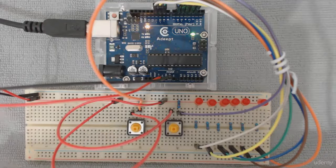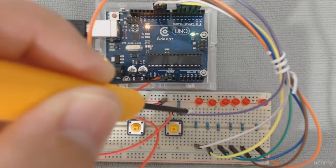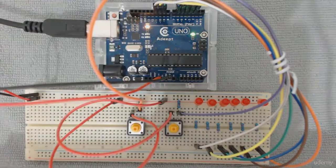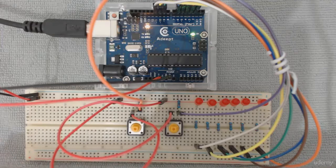We learned to use digital input and output. The output is using LEDs that are connected with a resistor that is used to limit the current. In addition, we connected 2 push buttons as digital input, and we are triggering some event based on that action. Now let's review the sketch itself to understand how exactly we achieved that scenario.